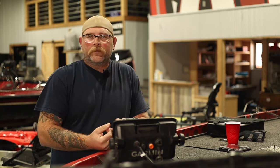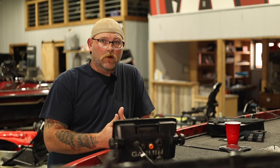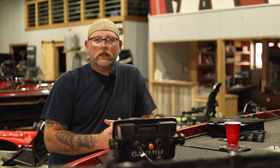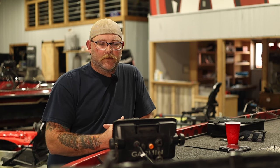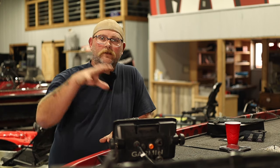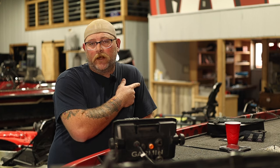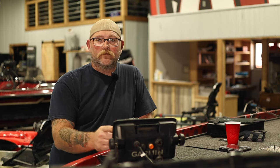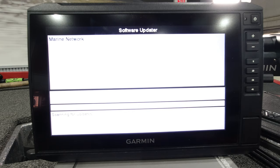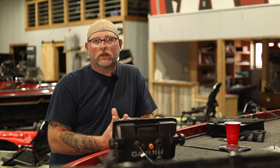Here's something cool to talk about while this is cooking. If you have other devices on your boat — most of the time with installations we're talking about multiple graphs and generally with Garmin a LiveScope — anything connected via the marine network, your ethernet cables, you can do all of the updates from a single graph. So if I've got a unit at the bow, LiveScope at the bow, and a unit on the console, I'll generally do this process from the console. A single ActiveCaptain card will update everything all at once. Right now it's scanning the marine network — I don't have anything hooked up to this unit so it should scan quickly and move right along. Keep that in mind: if you have multiple units hooked up in a network, you only have to go through this process one time and the unit will automatically update the other items on the network without any further action.